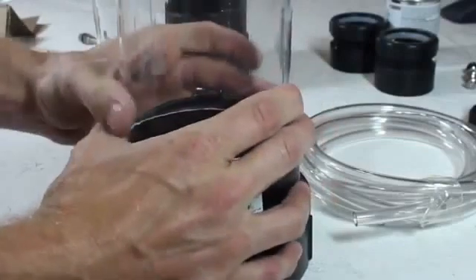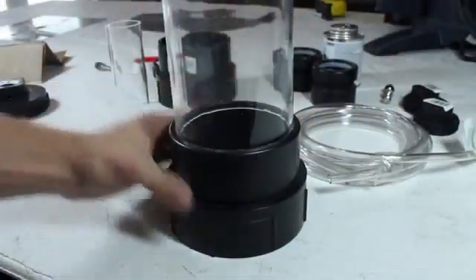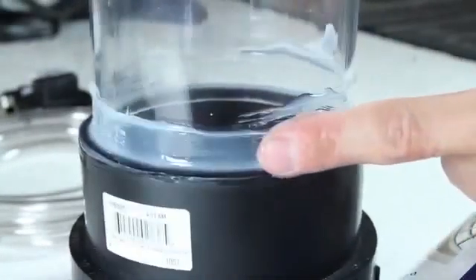After I've cut 5 inches of the 2 inch tubing, it's time to make some connections. With some gentle persuasion, I've managed to fit the large acrylic tube into the clean out adapter, but before we push them together, let's add a liberal amount of clear silicone caulking all around the outer base. This will also go on the inside, being very careful not to get any silicone on the threads.